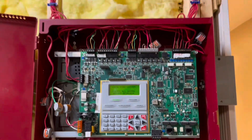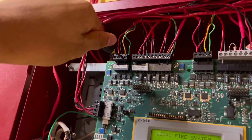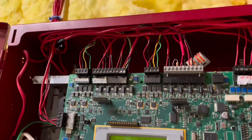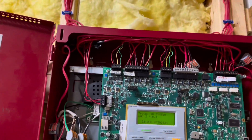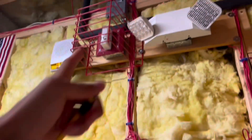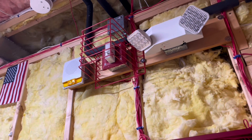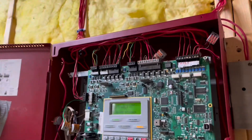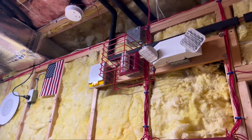Because I'm transitioning from horns to speakers, I'm going to do this as a precaution. What I'm doing here is removing the audible signaling wires from the panel's NACs. The reason I'm doing that is because in the event that the alarm accidentally gets tripped while I'm working on the system, it's going to be bad — if I have speakers on the system and 24 volts gets sent through the speaker circuit, that could damage the speakers. And the same applies in reverse because if I connect these to the amplifiers and I trip the system, then the amplifiers are going to run these horns, which is not right. I don't know if that would actually cause any damage, but it's best to not find out.